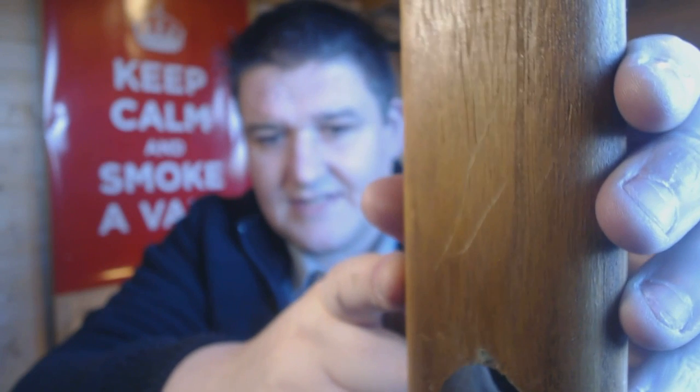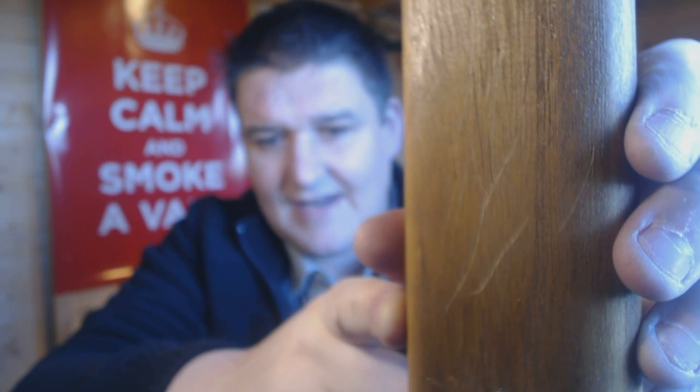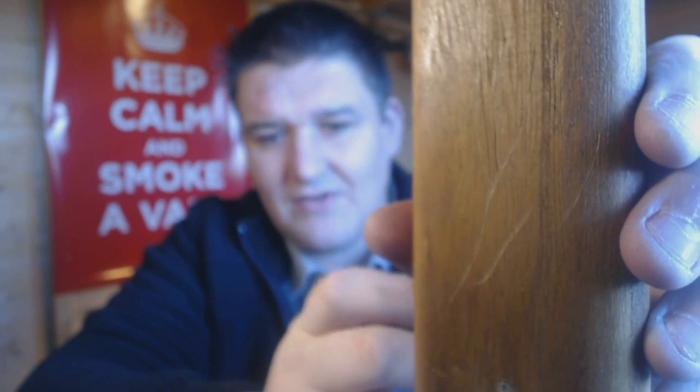Now, those scratches have gone down into the metal, shall we say. And what you do is you get sandpaper and you're going to basically flatten out the metal until it's the same depth as the scratches. So you're polishing them out. You're actually reducing the level of the stainless steel, if that makes sense. So that's how you get rid of scratches. You use sandpaper to reduce the metal.